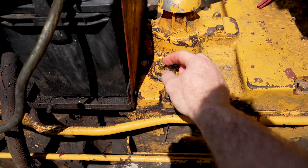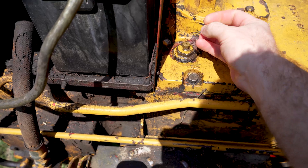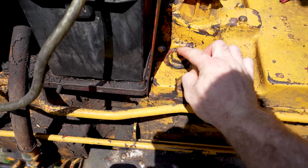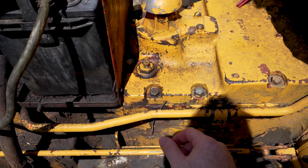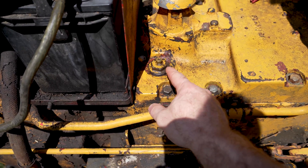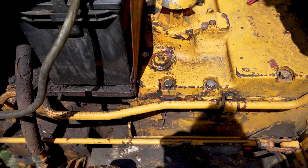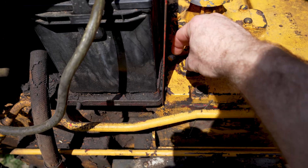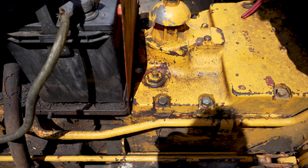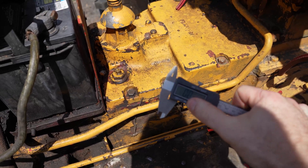So what's the issue? Right here, this little cap is where you put the hydraulic fluid in. It's got this little plug in it with a cotter pin, and it needs to be open for pressure so air can escape when pressure builds up. I can't seal it, but the issue is when it rains, water gets in there and gets into the hydraulic fluid and makes a mess.